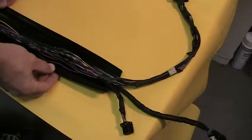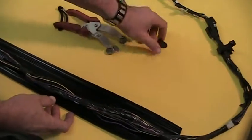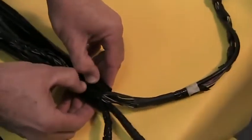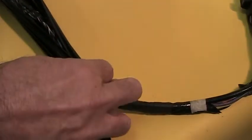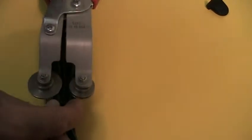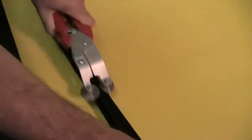Closing D-Track with the stainless steel plier tool is very similar to using the slider tool in the beginning. You wrap the tubing around the end of the cable, push the track together manually with your fingers for an inch or so, and then install the tool into the little ears. Then simply slide it along, and you can do footage extremely fast with the plier tool.